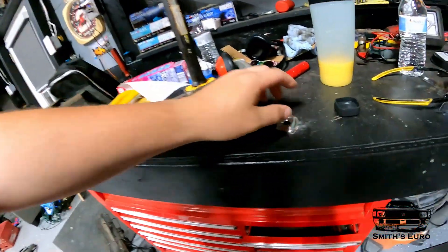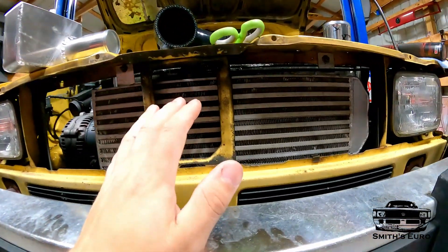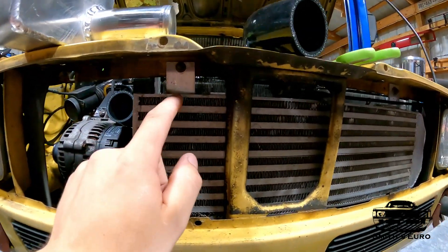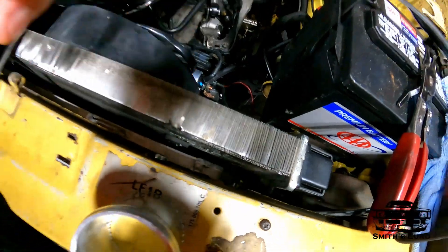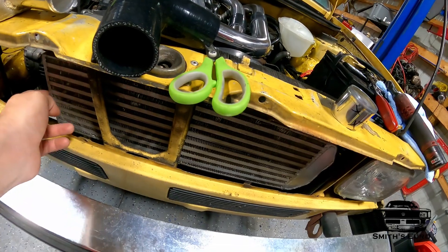What I'm going to try to do is see if I can use a 180 flange, which makes the most sense — you can do it on an ABA and on a VR6, so I don't see why you can't do it here. I found this intercooler and it's mounted pretty center, far over because I have the rad right here. I've welded two little tabs and drilled through the core support so it's hidden — two bolts coming through holding the intercooler in place.